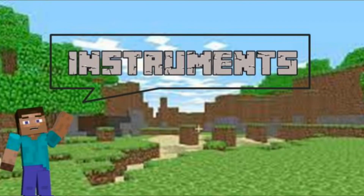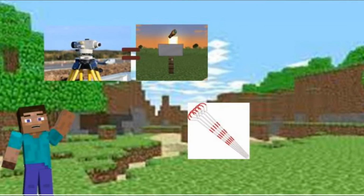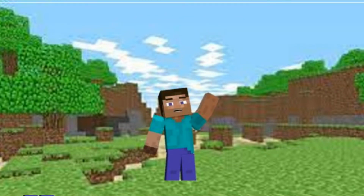The instruments that will be used in this fieldwork will be the same as with the previous fieldwork, which is a precise level, marking pins, and a leveling rod. Contrary to the name of the double rodding method, it does not mean that two leveling rods are needed for this fieldwork. The party must designate one chief of party, who will lead the full procedure.